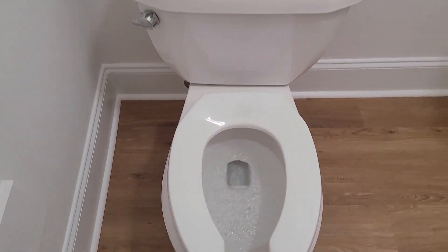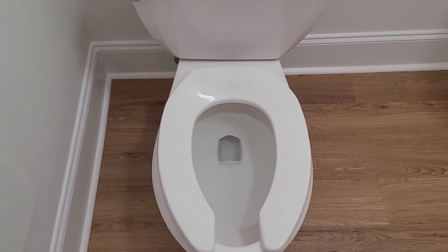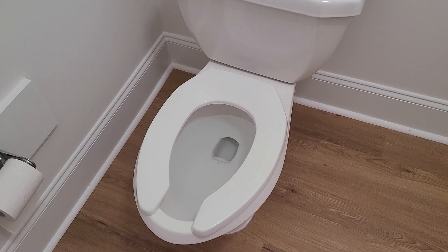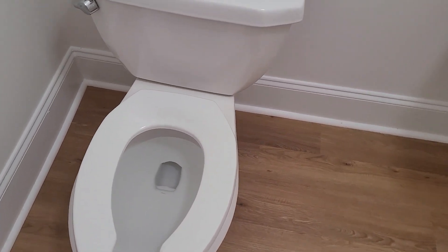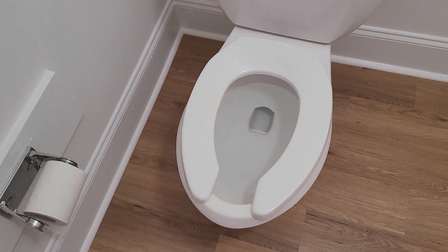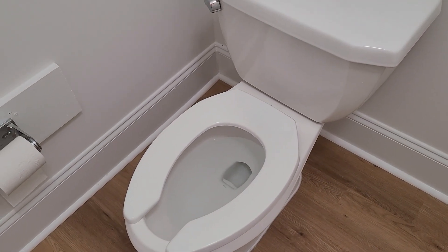The flush on this one is definitely a lot shorter because of the 503, which is why I'm not a huge fan of them. But this would have a longer flush if it had the original Flushmate. One of the main problems with these is how poorly they hold out. The flushes are pretty meh — they never swirl, they just go straight down. And the bowl rinse is known for not being the greatest either. But this one is surprisingly clean because of how rarely it's used. Bowl rinse in general is a problem with most pressure assisted toilets, even some of the better ones.